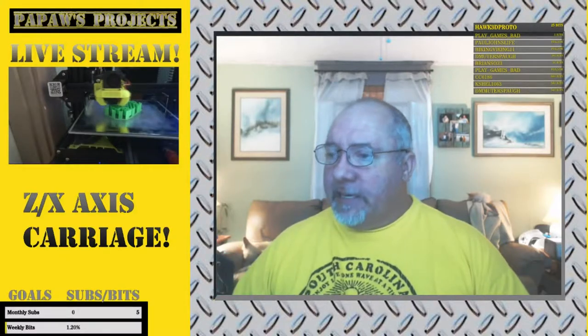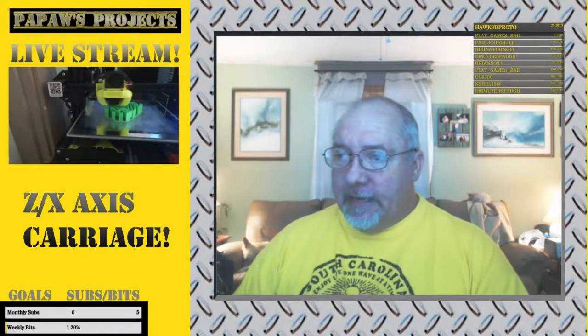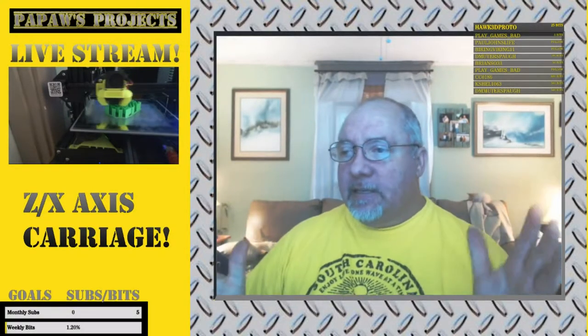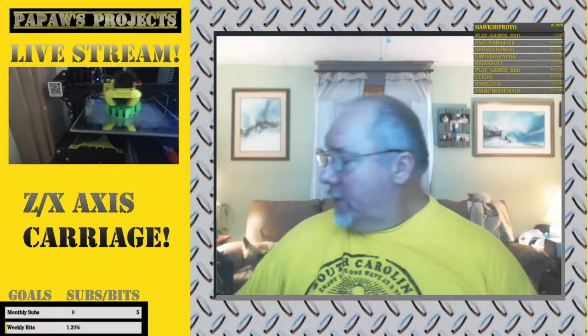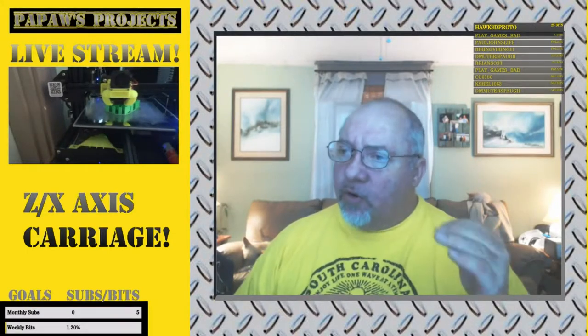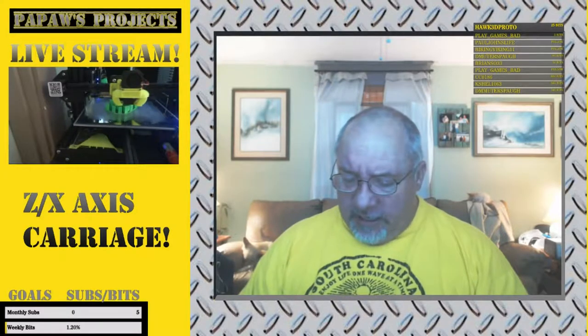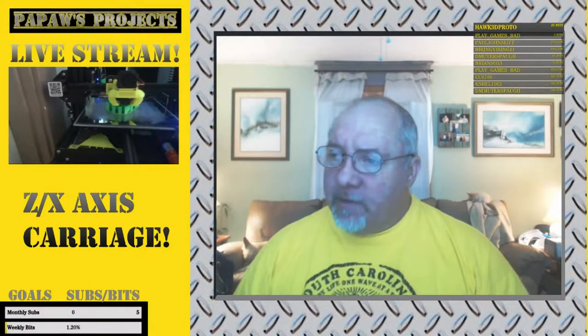After this one I knew I had to make some modifications because my belt was hitting my rollers. It lined up in Fusion 360 — everything I could see lined up perfect — but then when I put the wheels on, it was hitting the wheels. So I made some adjustments: I raised the motor up another five millimeters and scooted the belt slots out five millimeters so they would clear the wheels.